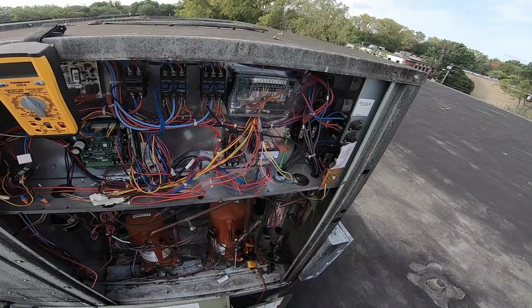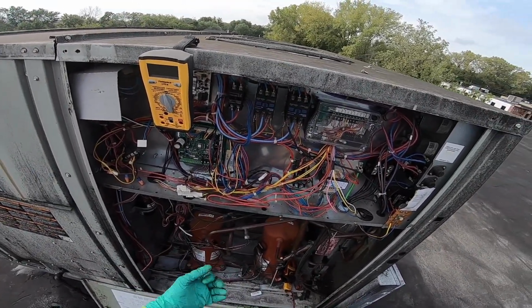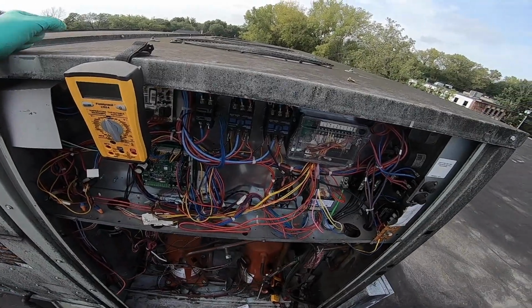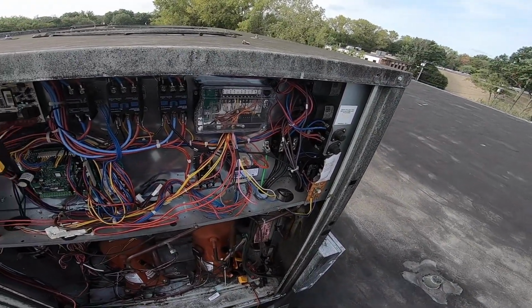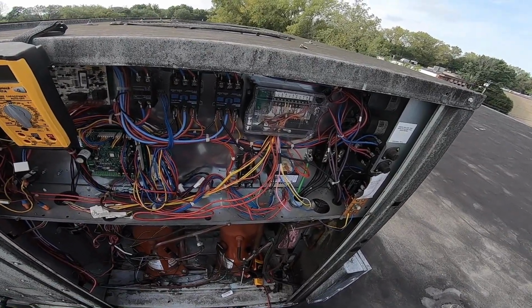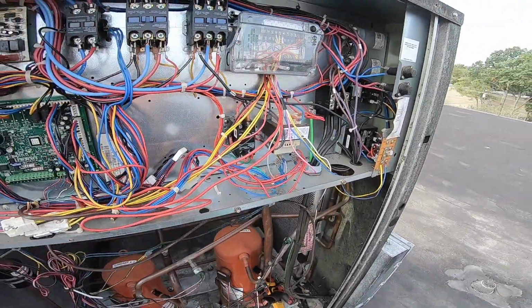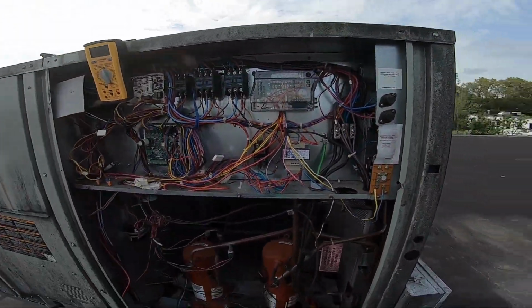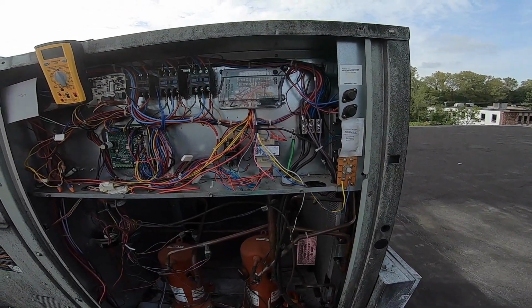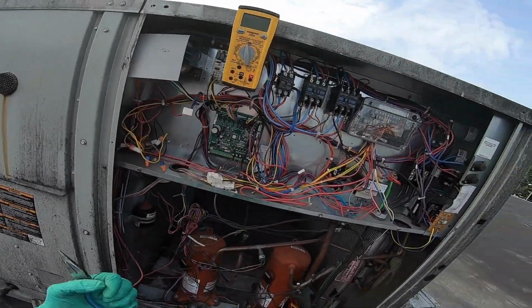Yes, it was tripped. Probably a power surge, dropped the voltage low enough. Didn't have enough power to pull in a contactor, and poof, raised the VA too high, then tripped it. I'm gonna say that's it, folks. I'm going somewhere else. But I'm not hustling. I'm not hustling at all.